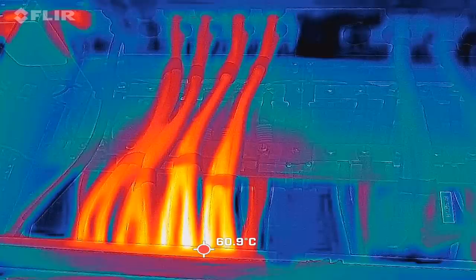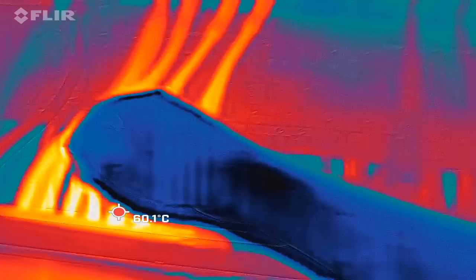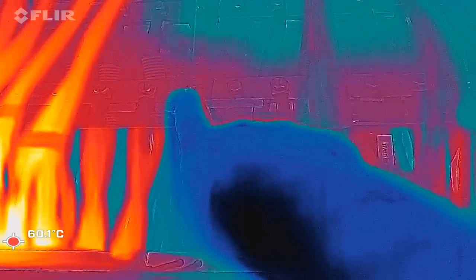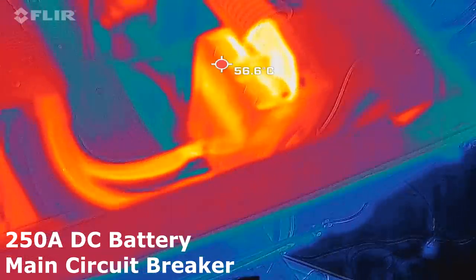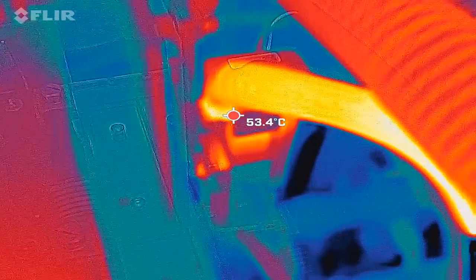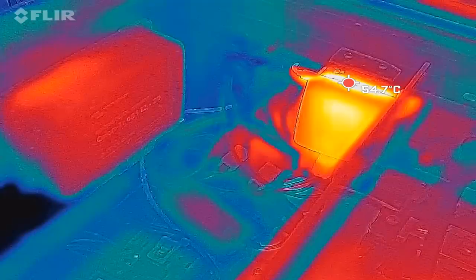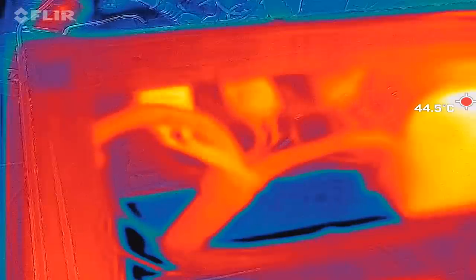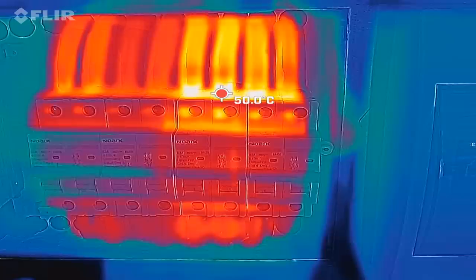The big cables here are 70mm going to the inverters. The inverter surface is about 50 degrees. Cables below 50 degrees — the bottom right is just reflection off the aluminium sheet. Now looking inside the DC compartment at the top of the shelf: temperatures of 60 degrees for the cables coming from the solar charge controllers going to the bus bar through the breakers. The circuit breaker contacts are at 56 degrees, the shunt at 53 degrees, the Raspberry Pi at 54 degrees, and the DC-DC converter from 48V to 12V is there as well.